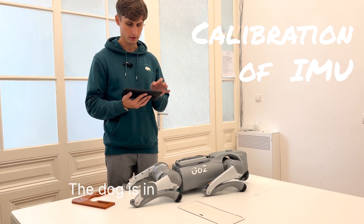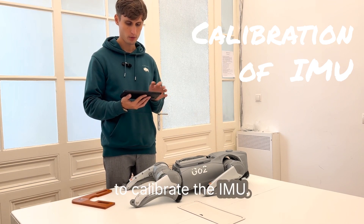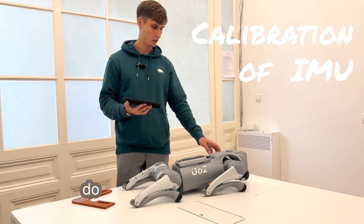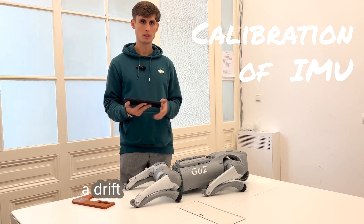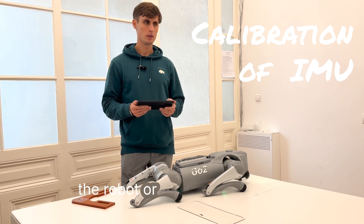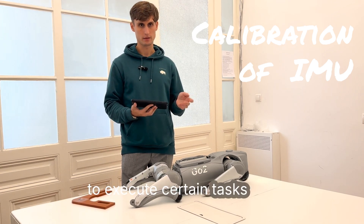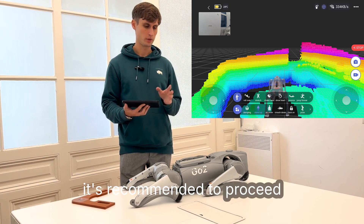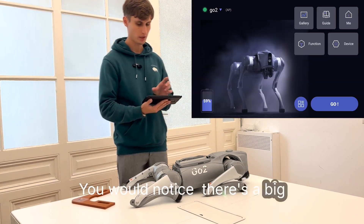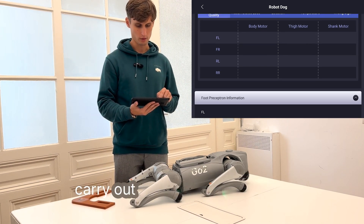The dog is in the desired position. We go back to the settings to calibrate the IMU. Usually you will have to do this if you see there is a drift when you're controlling the robot, or the robot is unable to execute certain tasks. Then it's recommended to proceed with recalibration. You'll also notice a big difference between the expected value and the real-time value.